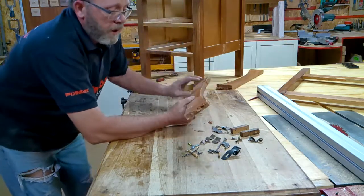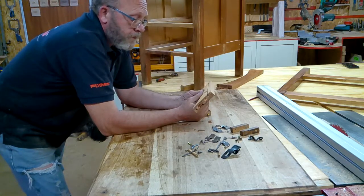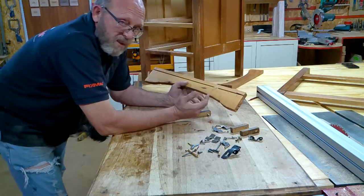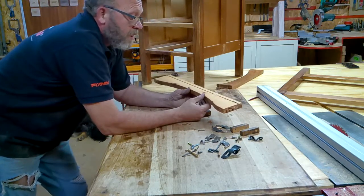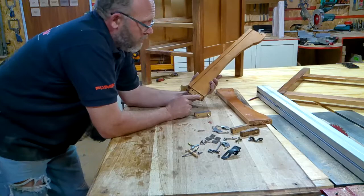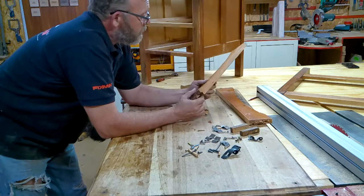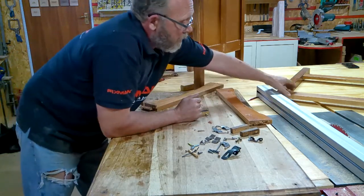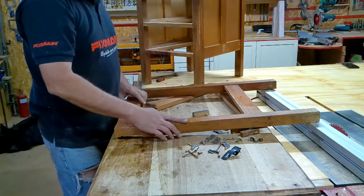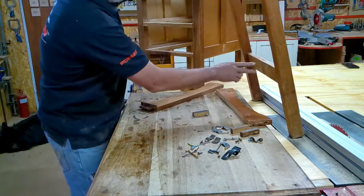There's some of the parts we're going to remake, like for example this one brace that keeps the leg to the drawer box. There's no tenons left, as you can see. We actually have some chewing gum. We can maybe use it for filling or something. But this one I'll have to remake definitely. The other one actually got some tenons left and parts of the leg is still glued to it. This one we can save and use. The main leg on the one side, I can save this, the brace that's from this leg towards the drawer box that is gone, so we'll have to remake that.